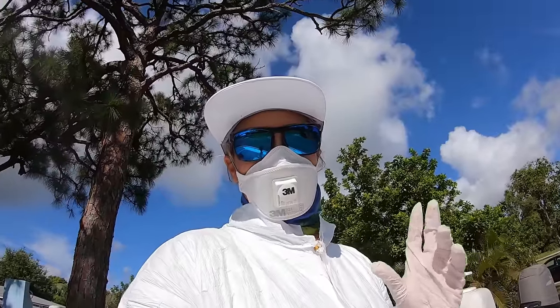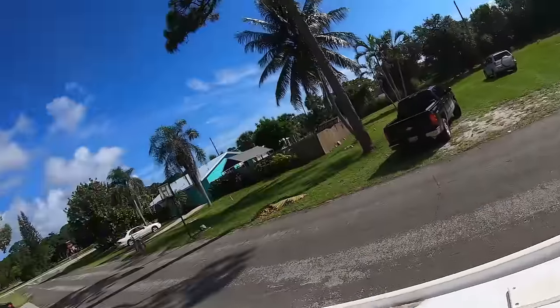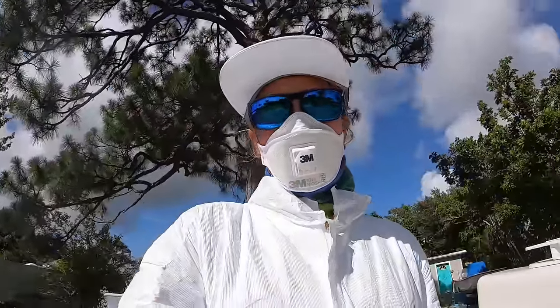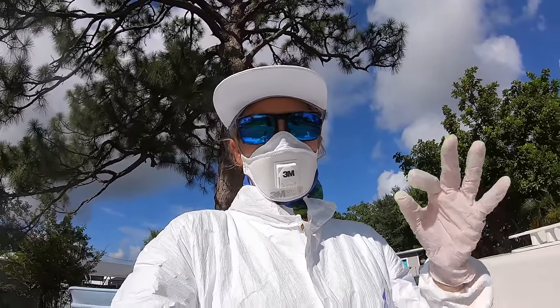We are now onto the taping process. We're going to be using 1-inch tape, and we're going to tape off down here, pretty much anywhere that we want to do, because we're doing the nonskid on the deck a different color than we are the gunnels. So we're just going to tape it off. We're going to make it look professional and pretty with nice lines. So let's lay the tape.